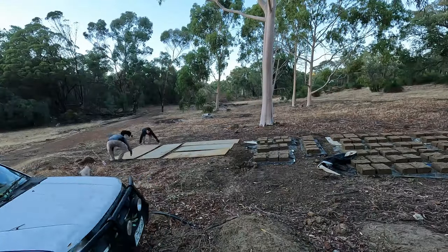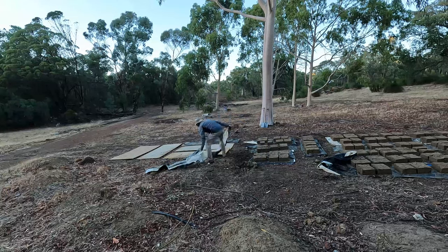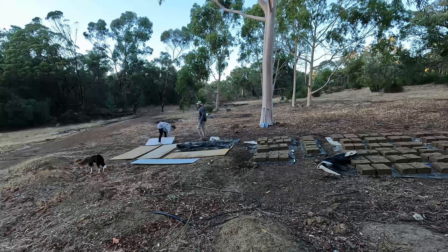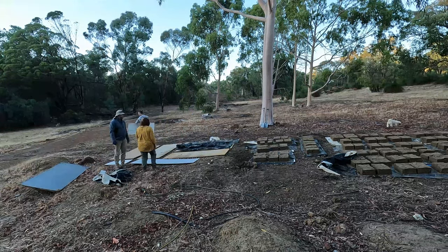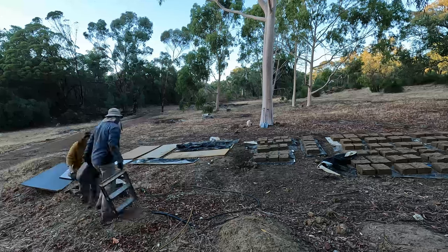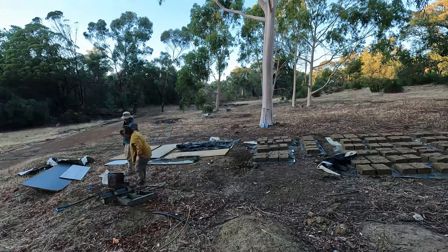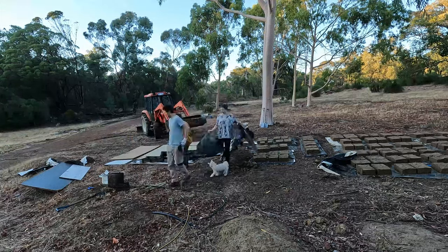From there it was a matter of setting up our space. We placed various types of boards on the ground — MDF, chipboard — whatever would give us a nice flat surface. From there we'd cover in plastics so that when we put mud down it wouldn't try and vacuum-adhere to the board, which would have been unfortunate when we later tried to lift the bricks. We would wet the molds so that the mud didn't stick to those as well and they were easier to lift off after we threw the mud into them.